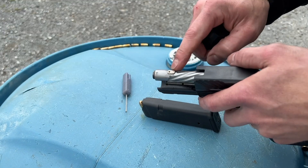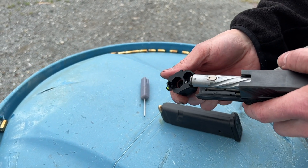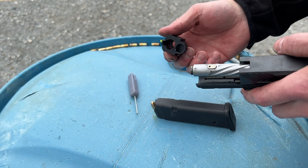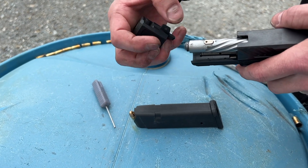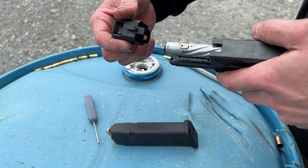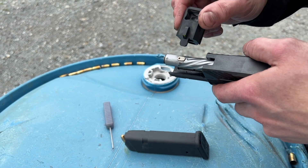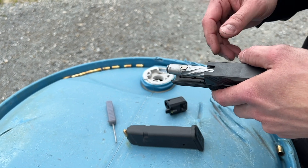All right, now check it out — there's the key. It is completely locked in place inside the channel in the compensator. It cannot come out. But the value is it's a little tiny bit wider than the space it occupies. It creates an interference fit so that this compensator can never twist. I know some people look at that and think maybe that's going to come out or something.